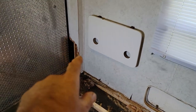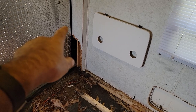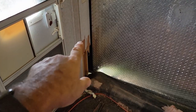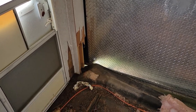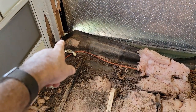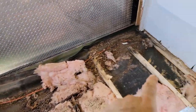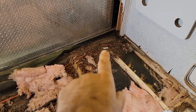On these sides over here I'll scribe a straight line, cut this off straight, and put a piece in there, then do the same thing on this side. Instead of nails I might use little screws in case I need to get back in there again for some reason. We're going to have to take care of where those wires come up — once the floor is in, I'll find where that was and drill up through there to get that marked in and then run the wires back up.